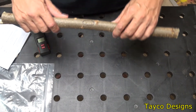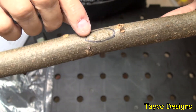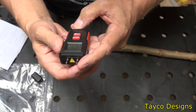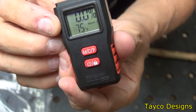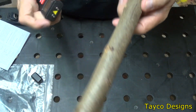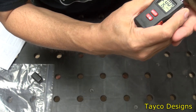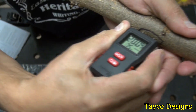I'm back — it's August 20th, several days after the first test. You can see the two prong holes in the wood from before. The moisture meter is on level one. The room temperature now shows 75 degrees. I'm putting the prongs into the same holes as before, and the meter now shows 20 percent moisture.